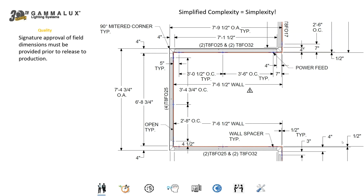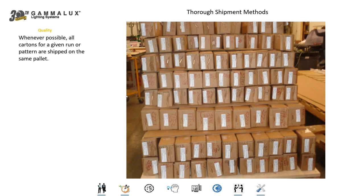We do require some information from the installer — specifically the wall-to-wall and corner-to-corner dimensions, because we're building these fixtures to fit those office cubbies. Our shop drawings use the designed dimensions, but we do not build to designed dimensions because walls are not built to design dimensions; there can be variances of several inches. This is why we require the installer's signed approval of the field dimensions. If there are any changes, they mark them up and send them to us, we revise and send for final approval. We don't use telescoping modules or spacers behind the fixtures because, while practical, they don't look good — and we want to get the second job.